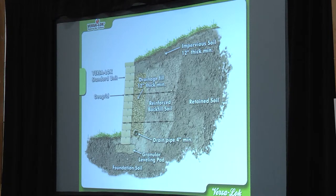If you look at this side view, we've got our block, and this is our geogrid cutting back into that angle of friction or into that shear plane. We've got the grid lengths long enough to get back into what we would call stable or sustainable soil — sustainable slope. A lot of different terms for that.